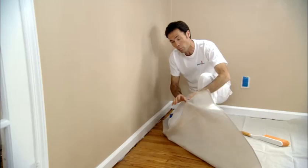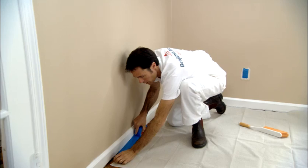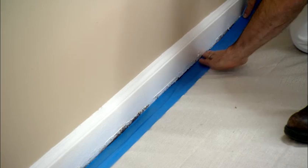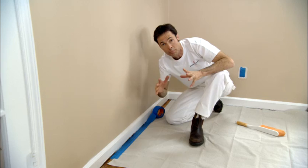Now it's important to cover the entire floor with drop cloths or dust sheets to protect it from paint and from dust. Use a wide painter's tape to adhere it to the floor — 50% of the tape goes on the drop cloth and the other half goes down onto the floor. You'll want to go tight against the baseboard, and rub the tape down nice and tight to prevent paint from getting underneath.